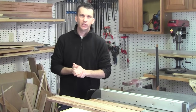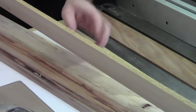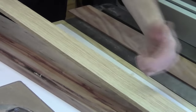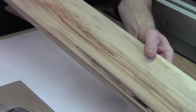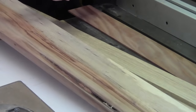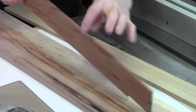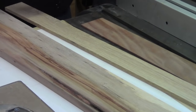For the sides of the box I'm going to use some white oak, already planed down to three-eighths of an inch thick — that's how thick the sides are going to be, about two and a quarter inches tall, and around three to three and a half inches in length. I'm also going to use some spalted pecan with a lot of nice color and figure, out of a three-quarter-inch piece, for the lid. And for the splines, I've planed down some mahogany to just a little more than an eighth of an inch — about a kerf width of the blade.